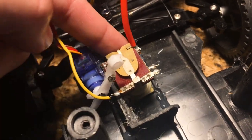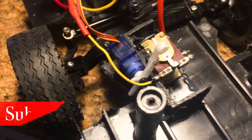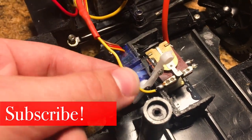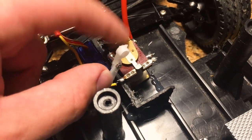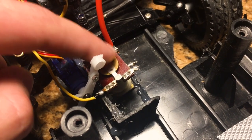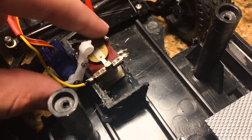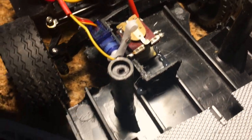And then through the pressure switch on this side, here is the other end of the wire. This is the positive wire. As you can see, it's yellow here, but it turns red later on. Basically, it's a disconnect. So when this pressure plate is pushed down, it connects the metal from both ends of the wire and finishes the current. It completes the electrical current.